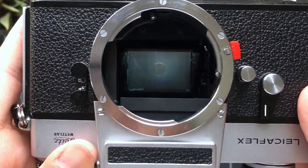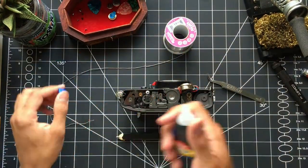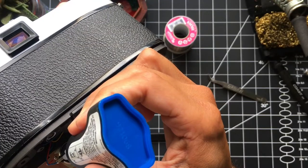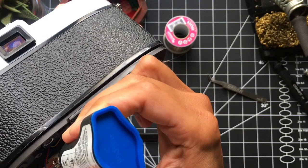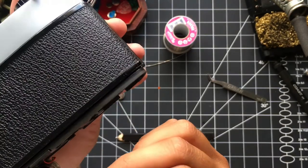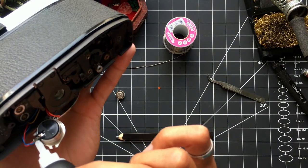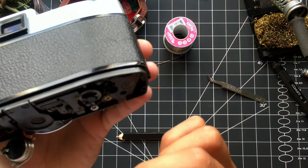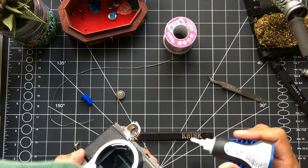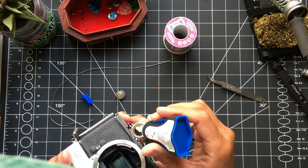You can see the little light sensor on the side here — I was pressing the battery tester on the side of the camera. Now that it's functioning, I'm going to use a little super glue to make sure that positive terminal isn't going to move. This also helps ensure the terminal — which is a little longer than the old one — won't accidentally short out to the body, which I assume is grounded. I put a nice coating around the entire terminal, and also applied some on the inside just to make sure it really won't move.